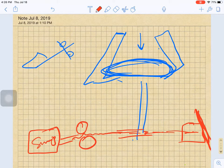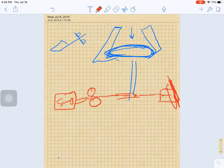And let's say this is your propeller. And it creates low pitch, high RPM. So at this point, the pitch of the propeller goes lower, and then it creates high RPM, so you can maintain that RPM same as you are in level flight. Hope that makes sense.